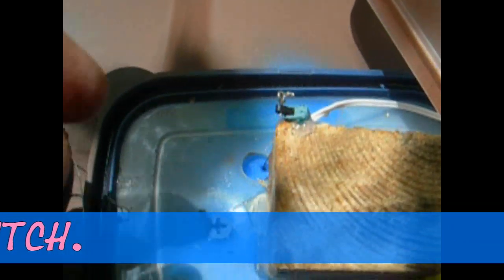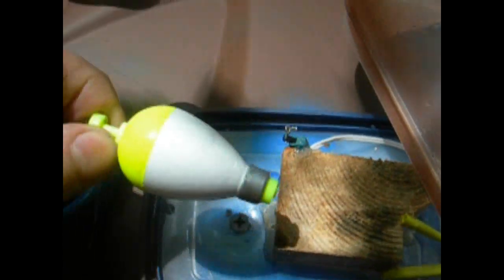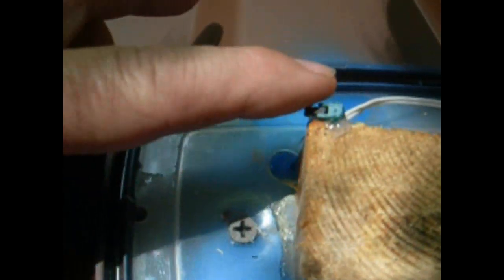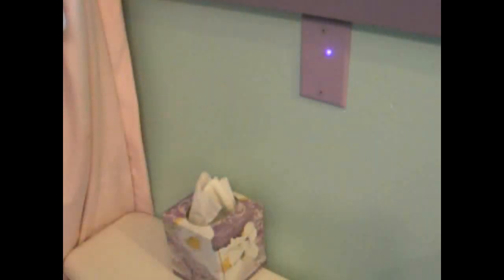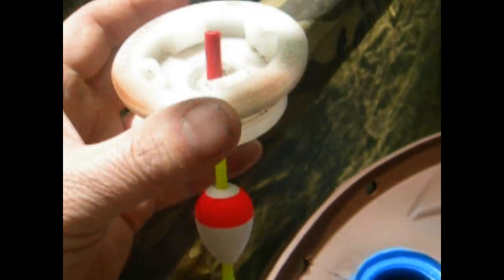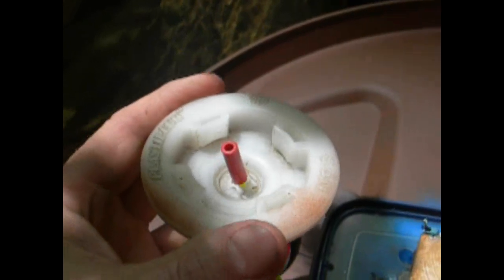This is my switch — I just have a micro switch, and this is for the LED. I have a little wire attached to it, I just drilled a hole and it goes down into the tank. On the other side of the string I just have a fishing bobber. What happens is that just sits down in my tank, and as long as there's water there, it floats and it doesn't do anything. But once the water gets down so low, it'll hang, and the weight of that will pull this switch down and hold it down — that will turn my LED on and let me know what's happening. Also on this cap here, I just took a fishing bobber cap so that'll let me know if it's filled or not. When the water is all the way up to the top, that thing will just stick up out of there.